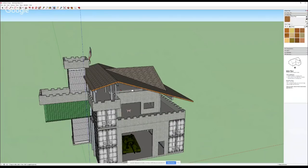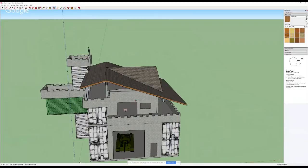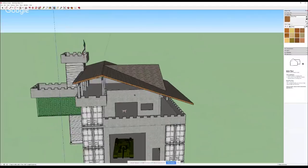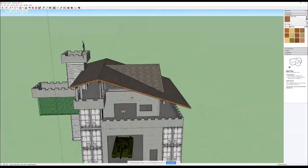Yeah, that's what I want. Hollow precast. Yeah, the top crane. You got to know, that's what I used on my other floors. It's hollow precast, and I got it used, but the guy didn't have any more. So I need four more of them. They're 4 foot wide panels, 8 inches thick, 24 feet long, which shouldn't be hard to get.